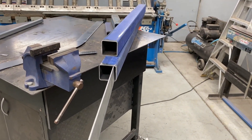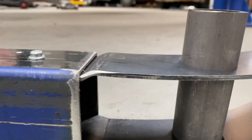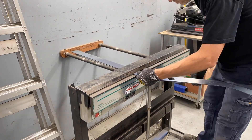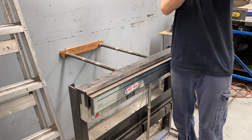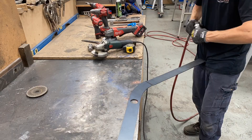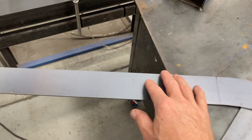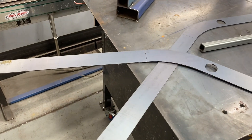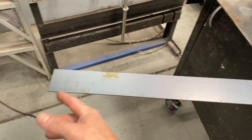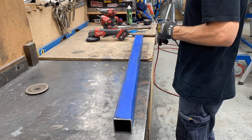The curved sections are laser cut to slide inside the square tube with a little step and a chamfer so it sits flush with the outside. I cut them over length, which I could have trimmed down as I only needed around 200mm of overlap. However I left them long to keep it square and for added strength. I drilled plenty of holes for the plug welds and screwed it all together.